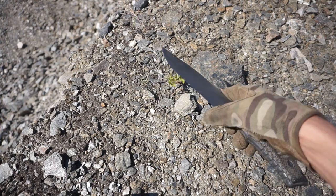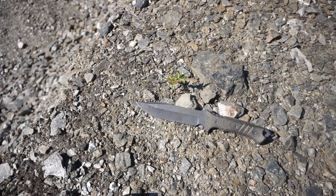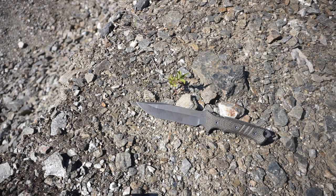There are also no chips or cracks — not even when I do my fingernail test on the blade. The overall toughness is, of course, not as tough as 5160. When you jump into stainless steels you have to give up some edge flexibility. However, CPM S35VN has not really been chipping out or cracking on me. It's just not as flexible or malleable as 5160, which being a spring steel is kind of its claim to fame.